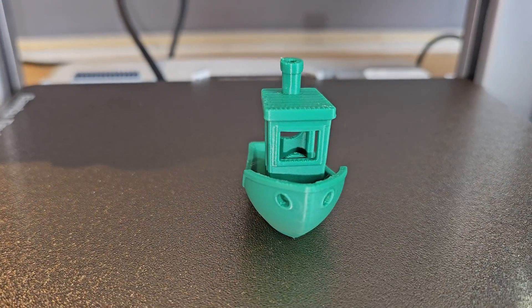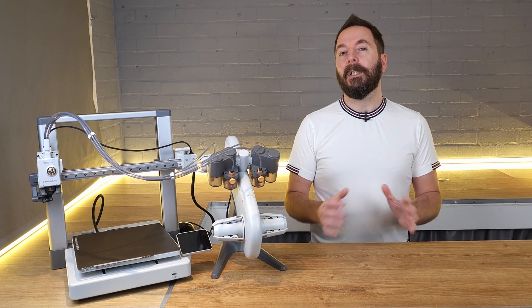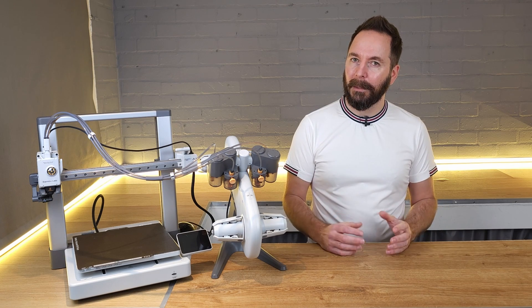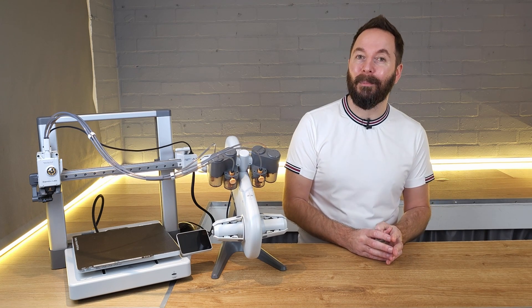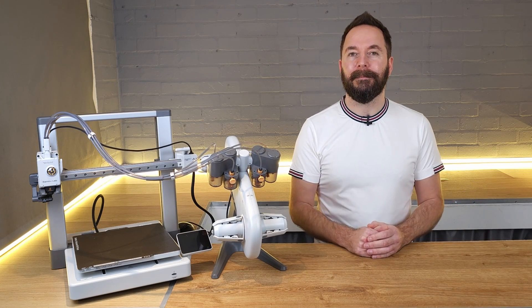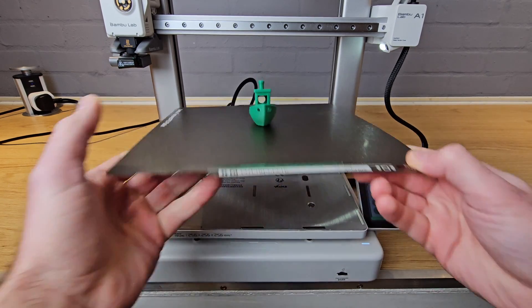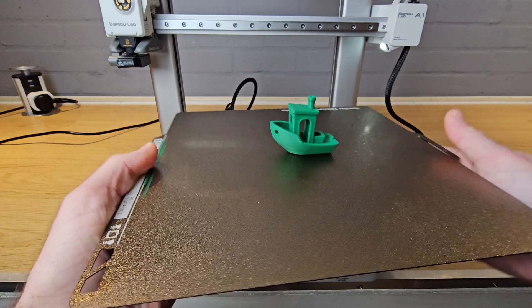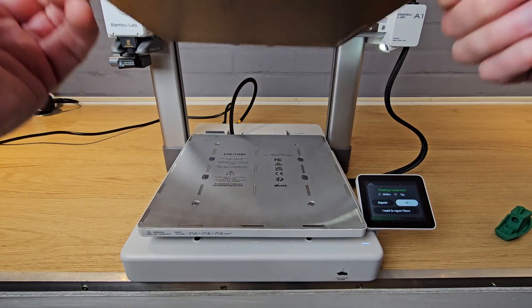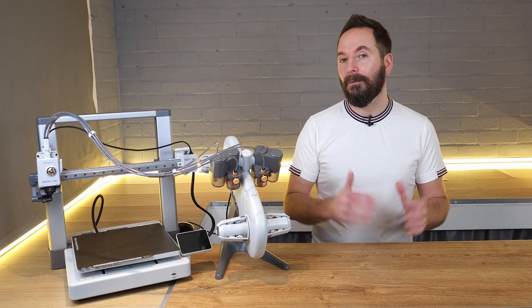When it's finished, wait a little while to let the bed cool down before trying to remove it. This is for two reasons: firstly, depending on the material, the bed could be hot enough to hurt until it's cooled down a bit; and secondly, the print surface is designed to let the print release when it's cooled, so removing the print will be easier. Once it's cooled, the best way to remove your print is to remove the entire magnetic print surface and then flex it in both directions, which will either release the print or make it much easier to pull free. Replace the print surface being careful to line it up straight again and then you're ready to run another print straight away if you want to.